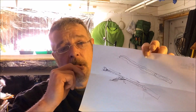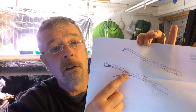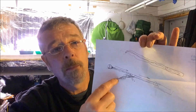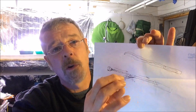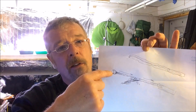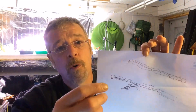Now my thoughts on this — it's an idea of whether it will work or not, I don't know. I want to put a 45-degree fitting in between and have that as my suction pump. I'd put some grill over the end, like centimetre mesh or something, just to stop big rocks from going in and blocking it up. And at the top end, some sort of funnel so that the water goes in like a flare on your sluice to push water through.